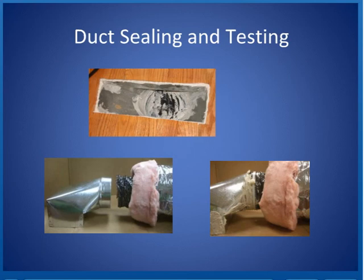Here's an example of how you apply the duct — it's two pictures out of a series of a dozen pictures. It's showing the duct and some flex at the bottom left. You put some mastic on the duct, pull the flex up over that mastic, and then tighten it down with a clamp. Then you pull the insulation over the whole thing and clamp it down, and you've got to seal the end of the insulation too if you're in a humid or moist climate.